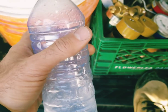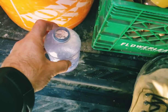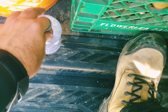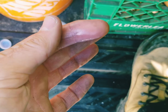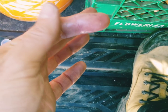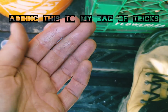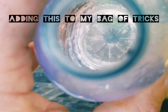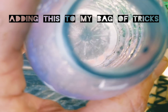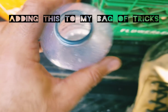When we shake it up, with oil and water on the side of the bottle, we've got no hard deposits. If I take my finger and run it on the inside, all I have is some oil residue. So I think we can conclude that AC Smart Seal quick shot, an oil-based product, does not harden up when it meets water or air. Happy HVACing guys.